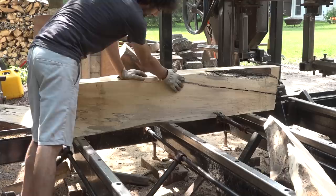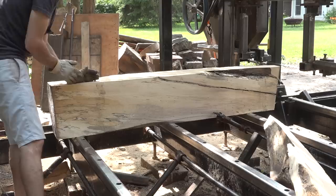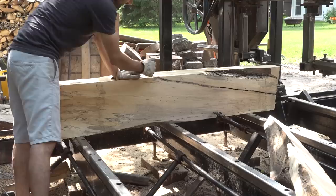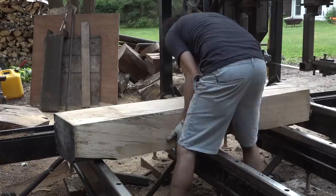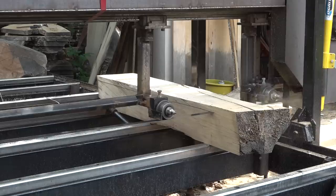So I'm thinking about how I want to cut this thing. It's got a crack on both faces — both on the top and down here. I can cut boards out of here and have some nice wide stuff, and it looks like the crack ends right here and then it's good. I can go from this side and get some narrower boards with a crack running through them. I think I'm going to go wide board — I'll probably be able to grab three decent four-quarter boards out of here and then maybe some weird chunk at the bottom.